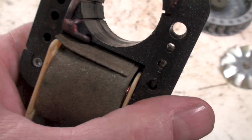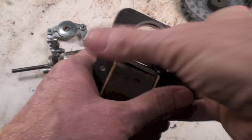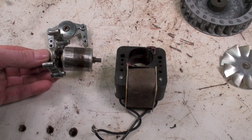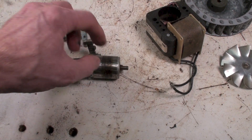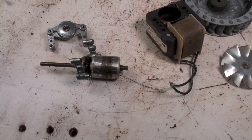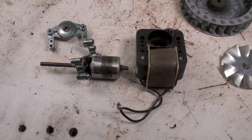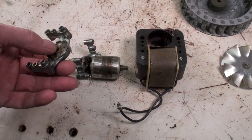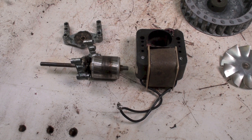The rotor is dragging on the stator — and they just won't run; they'll jam. These motors are generally not repairable. The bearings are just bronze bushings, and once they're worn out that's it — there's nothing you can do. Occasionally you can oil them up and that'll give them enough clearance to run for a day or two, but then they lock up again. That's what happened to the inducer on this Lennox furnace.